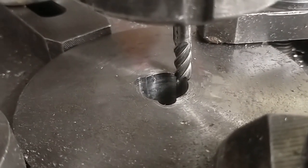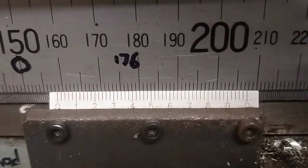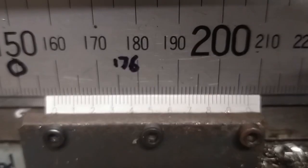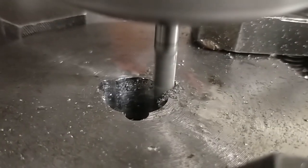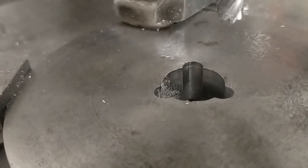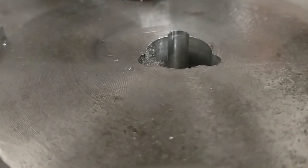So now we've got our keyways roughed out, we'll have a half mil finish. I've lubed it up with coconut oil, so we're on 17, 8 and a half. We've done our keyways on the 17mm mark, smack on the equator, and the next step is to put a little register around here for dialling in once I get it into the lathe to trim down the billet size to the blank size for the gear.